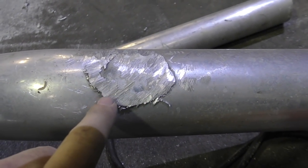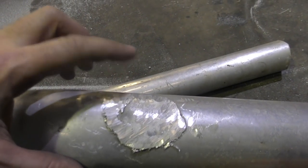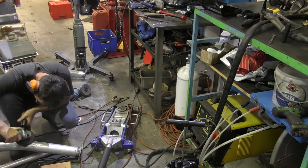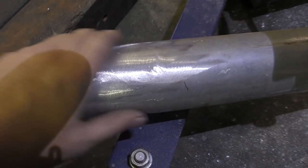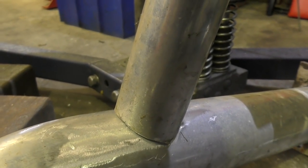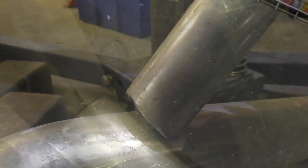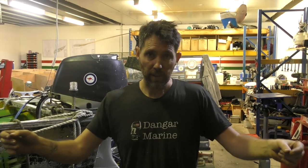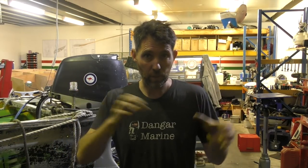I've got them to about this stage with the grinding disc and now I'm going to use the flap disc to neaten it up. Looks like I've gone a bit too deep in places, but never mind — it'll suit the green machine. What I'm going to do now is use the flap disc to do a final bit of shaping on this arm to make it the tightest fit I can around this upright. I simply put them together, figure out where it touches first, where there's a gap, and grind away the point it's touching until the other points just start to meet. Then I'll bolt the two arms into the rollick to get a sense of where I need to mount the crossbar.